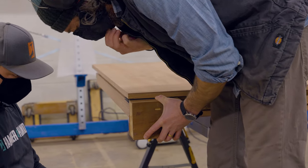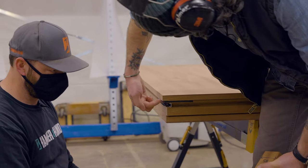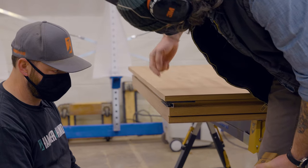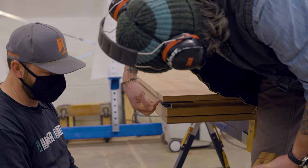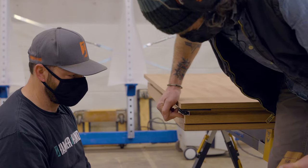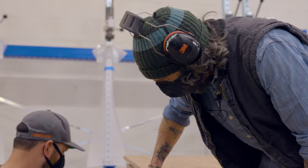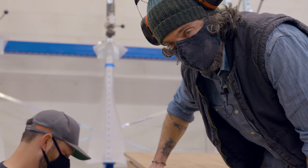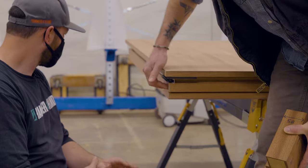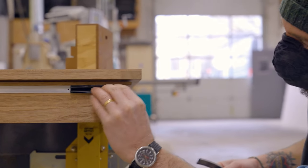It sits right in there. We have one gasket, two gaskets — this one here goes continuous around the perimeter. We have a double sweep here, and then an automatic door bottom seal that we're going to rout in later. It's a German-made Athmer brand drop sweep that has an airtight seal. We also have another gasket on the frame, so that's three seals on all four edges.